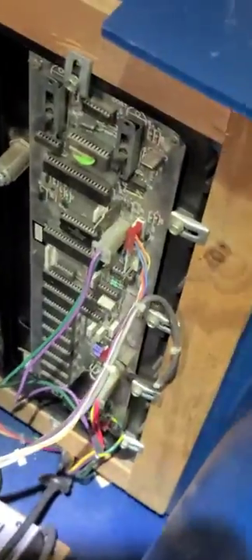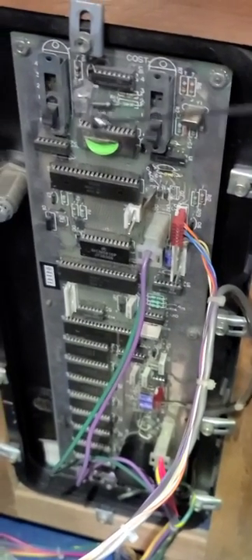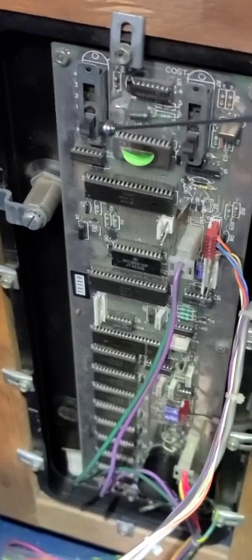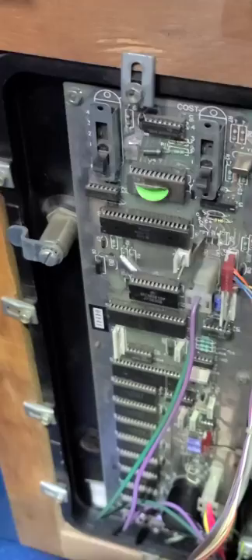The back door's got the PCB here. With the table not mounted on, the ribbon cable's not on and a couple other connections, but this is what an 83 board will look like. You've got your time settings and coin settings here — I've got it on one coin and the maximum amount of time. Well, maybe that's on the shortest time; I need to bump it up. If you want max time, it's all the way up.